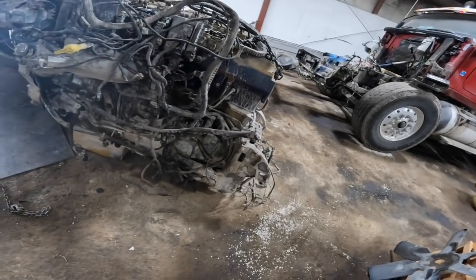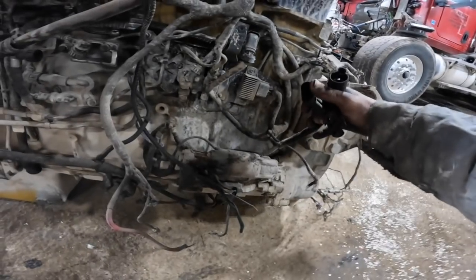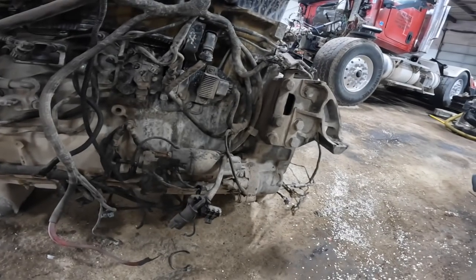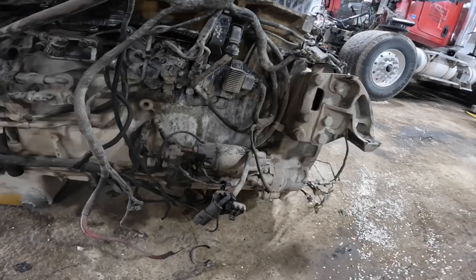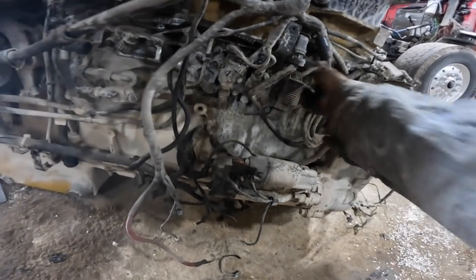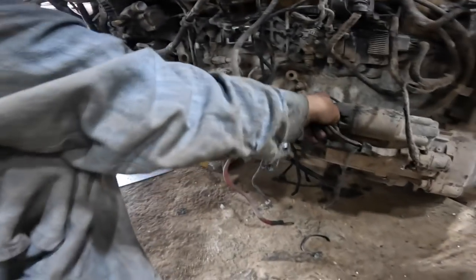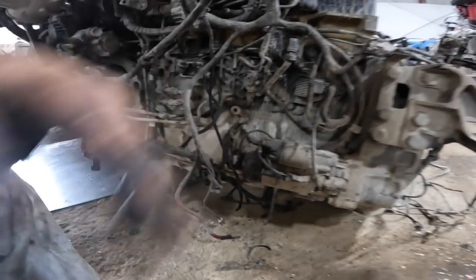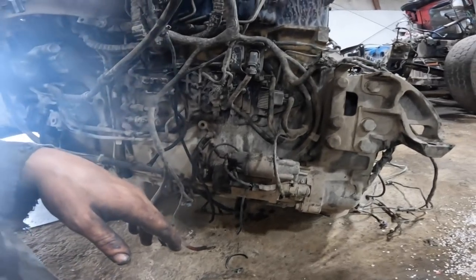Something I was wondering about. Is that just going to be on this thing? I mean, it's still got, it should have a cat ring gear, I would suppose. That should be like an MT39. I wonder if we could stick that starter, if it would bolt on there. I'm really curious. I'm gonna crane over and grab the other engine and get it around behind the truck. Because those MT39s are a way better starter than them old Delco MT40s are. MT42s and stuff like that. They spin over faster. All that kind of good stuff. So, just really thinking that I might do that, and just put that starter on that. I think the tooth count should be the same on the pinion gear. And then we'll see what we run into, I guess, huh?